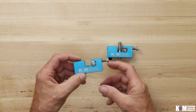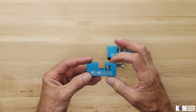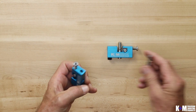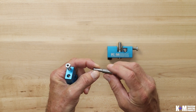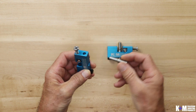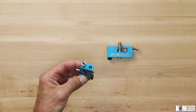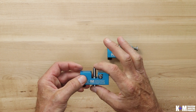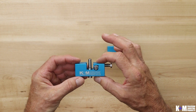Next let's talk about how to install the pilot into your neck turner. If you purchased your neck turner from one of our dealers, there's a good chance it came without a pilot, so you'll have to make that installation yourself. It's pretty simple — all of our pilots have a flat ground on them for the clamping screw inside the body down in this recess. Simply slide the pilot into the neck turner body aligned with that screw and snug up the screw. At this point don't worry about the position of the pilot — that's something you'll take care of later during tool setup.